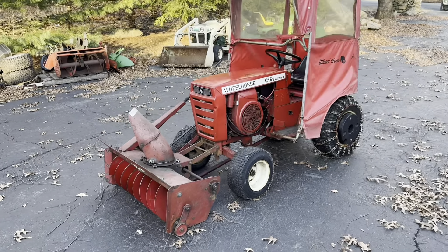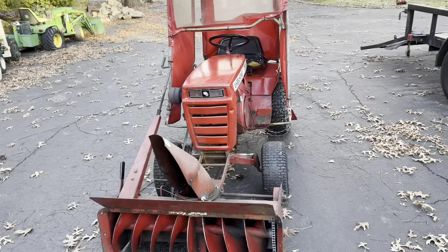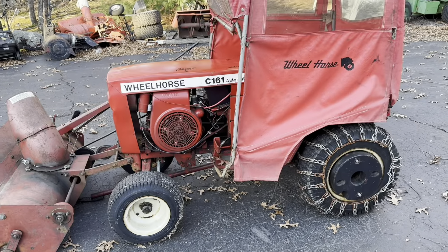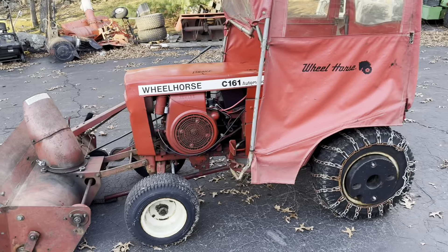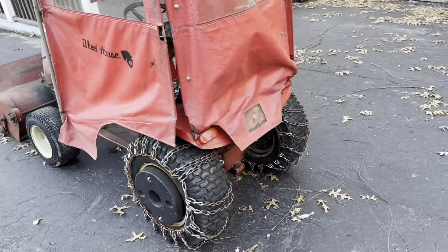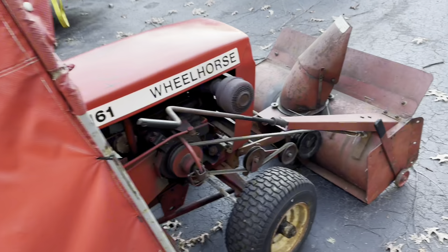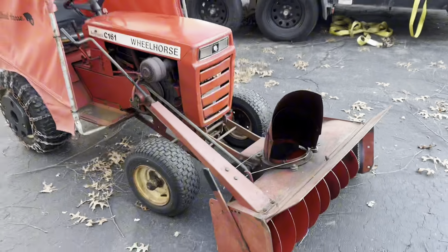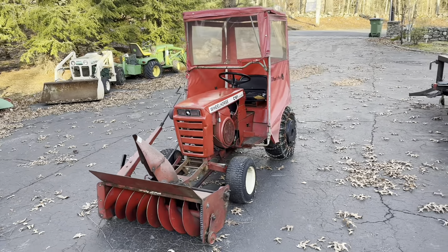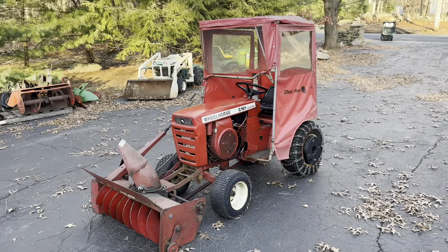There she is. Hooked the snowblower up on it, got the snowblower working, up and down hydraulics work, all that good stuff. You can angle the chute right from the driver's seat. It runs and drives real well. I did end up cleaning the points on it, putting a new air filter on it. I put some carb and injector cleaner in the tank, which usually helps these out especially if they've been sitting for a while. I filled the tank up with some more fresh gas. It stumbled once or twice but everything seems good on it. I may end up pulling that carb and putting a kit in it, but I'm not sure yet. All the headlights and taillights work. It's got some nice chains on it, got some nice weights. No smoke, no knocking — engine runs real strong, sounds good. It's a great-looking tractor. I'm very, very happy with it — this thing's great. I'm looking forward to listing it up for sale here soon and finding someone who is really excited to use it and give it some purpose in life again, because it's been sitting for a while. Thanks for watching, have a good one.